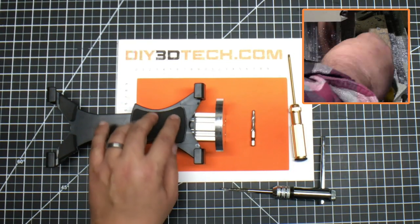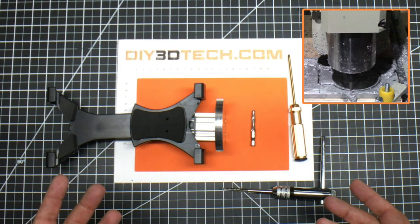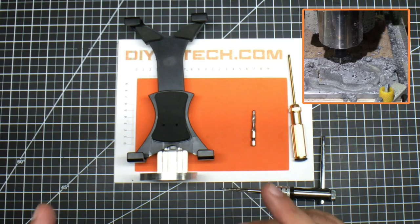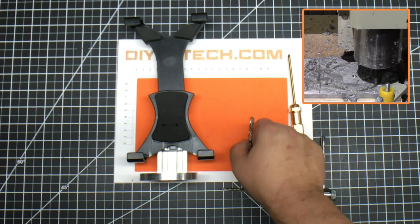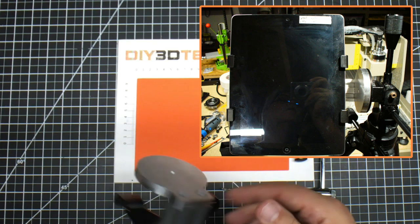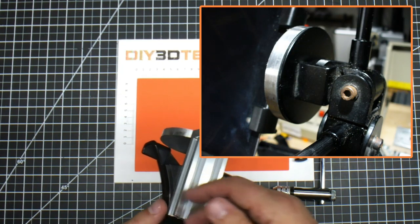When I finish this I'll take a little bit of glue and glue this right back down into place. iPad goes on here and Bob's your uncle. The idea of the design talk series is to share not really a step-by-step build, but the thinking that goes behind designing the part. When you're designing parts you're thinking: I need to leave that hole a little undersized and bring it to the proper diameter with the drill tap bit — that way first round I'm going to have a good fit. I need to figure out my pocket depth for my bolt sizes to get a proper fit. Also thinking about how to retrofit a part — I was able to reuse this because it's sturdy; it was the flimsy bracket doing the connections, and I can 3D print a part to go in here.